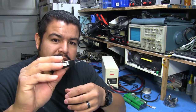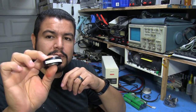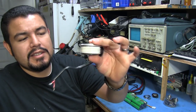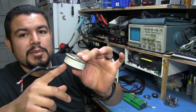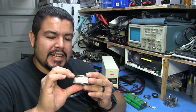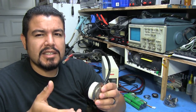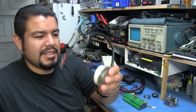Using a standard TO220 MOSFET to dump that much energy wouldn't be feasible — it would probably just explode. So I used a hockey puck SCR rated at 158 amps at 1200 volts, which was more than enough. There are even larger ones available — one here looks like a sandwich cookie — rated at around 1500 amps at 600 volts, but that's bigger than what I needed.